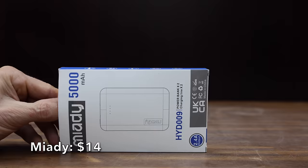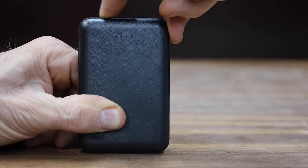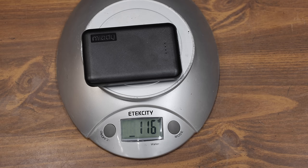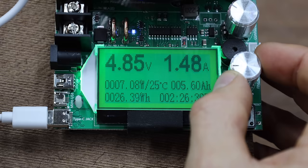At a price of $14 is the Miotti power bank — and what's nice is you get two different power banks for $14. Each is rated for 5,000 milliamp hours. Like the S22 Mini, the Miotti is very popular with 6,000 units sold in the last 30 days. The Miotti is made in China and weighs 116 grams. Neither of the two Miotti units I bought has a functional USB-C for charging devices — that port is only good for charging the power bank. Testing the USB-A port, the Miotti made it to 12.61 watts, about a watt better than the S22 before giving up.